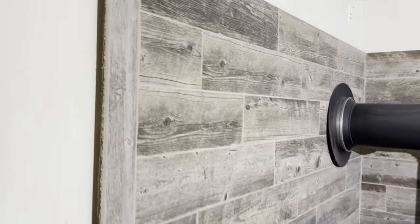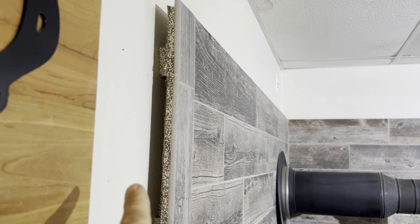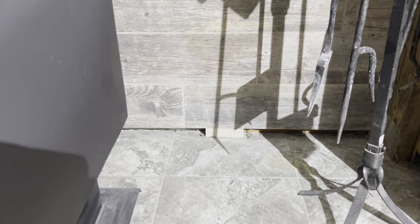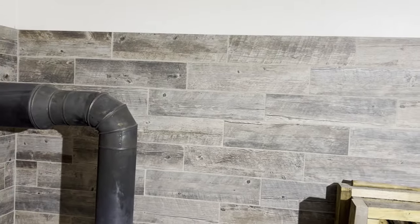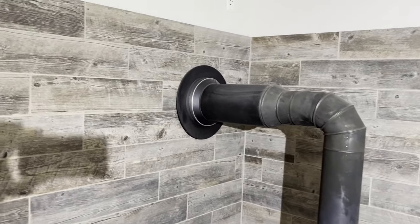I'll show you here. If you look over to the side, you can see I have a one-inch barrier between the heat shield and the sheetrock so air can flow between them. You can go up through the top and also down through the bottom. Down at the bottom I have about an inch and a quarter off the floor as an air space, so the air has the opportunity to go underneath, up behind, and then heat rises out the top. So on all four sides the heat can go any direction, and that helps keep the air moving — keeping hot points away from the stove area, flowing around the room and off the sheetrock and two-by-fours.